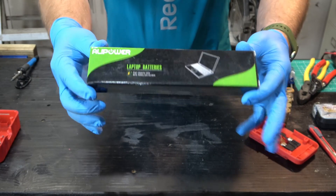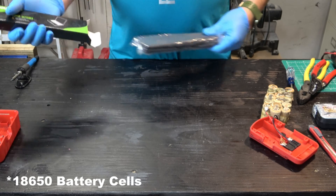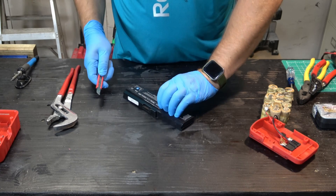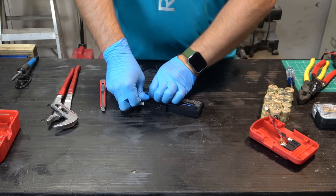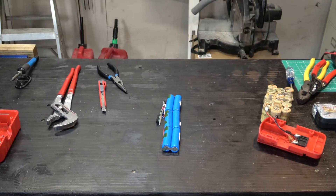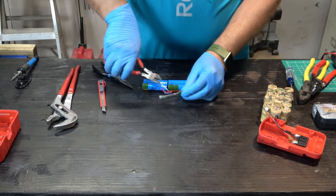For the laptop batteries to get the cells out, you can just get anything generic that's cheap. A laptop battery usually has about 6 cells in it, so we'll take that apart. Depending on the design of the laptop battery, I found that anything from squeezing it to break it apart with channel locks can work, or you can cut it open and pull it apart with various pliers. After taking them apart, you're going to want to remove the little circuit board that's attached to the batteries — that's just a BMS that helps keep them from getting overcharged and lighting on fire.